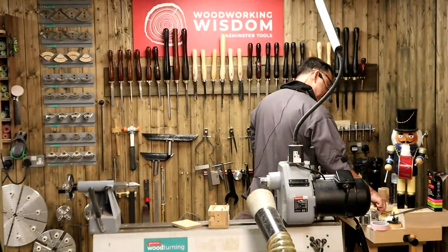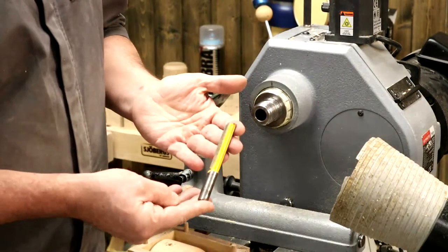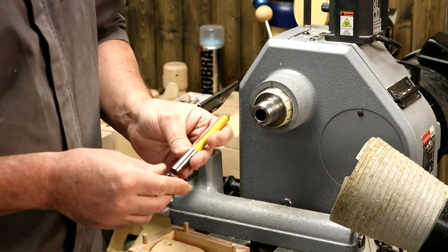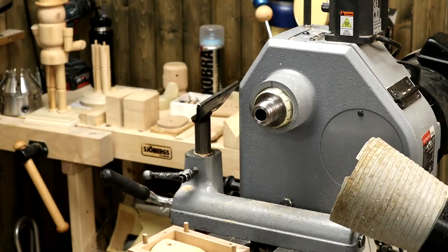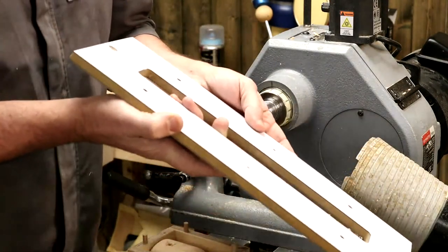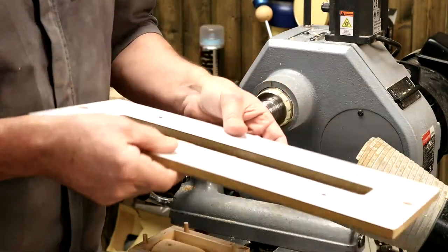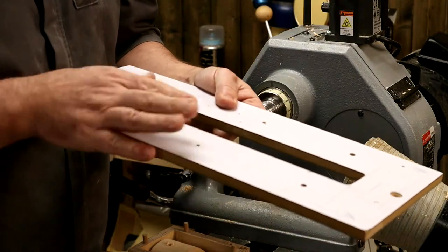worktop cutters. So these are the longest cutters that I can use. So they are half inch because of the depth that we're going to. And by the way, the lid of that router box is only thin material. It's only 9 mil, and this is a bit of shower wall. So it's a high density fiber board. And it also has an incredibly slippery surface. So brilliant for doing this sort of thing.